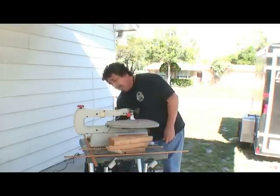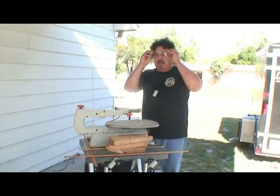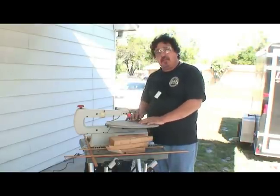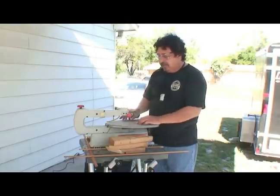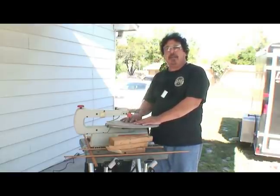Make sure it's in all the way. The next thing to do is always wear your safety glasses. I always wear them with the angles on them for safety. You always want to make sure you keep your hands away from this reciprocating blade. It's very small, but it's very sharp. And there is a unit here that we'll explain later that will add to the safety to keep that board from bouncing.